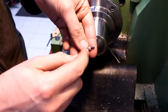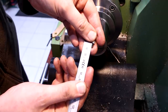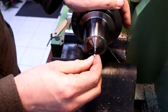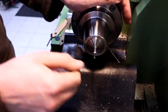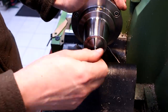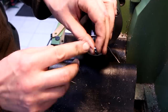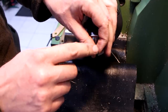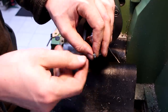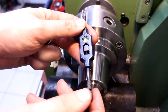Then I have a screw M3 with two nuts jam-nutted against each other, set to my thread depth plus a little bit of air. This is what I use to check if my thread is deep enough. If the nuts screw all the way up against the face of the part, I know my threads are deep enough. That's a little bonus trick — a very cheap solution. It's a good idea to file or turn the face of the screw flat, because usually rolled threads have a little burr and you don't want that in your brand new thread.